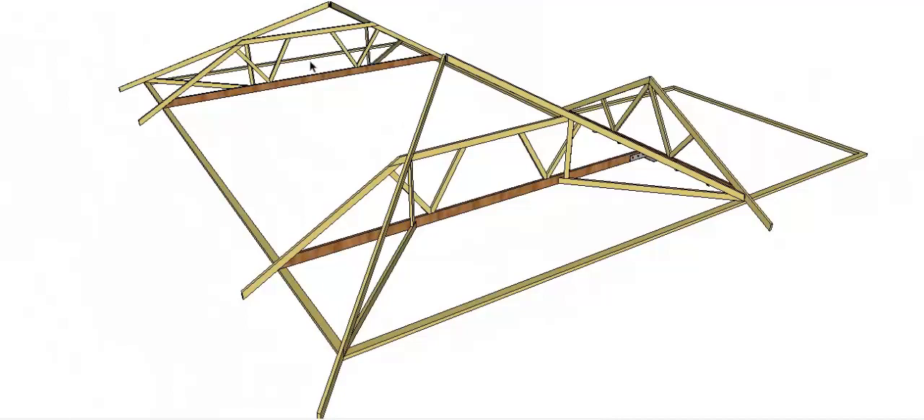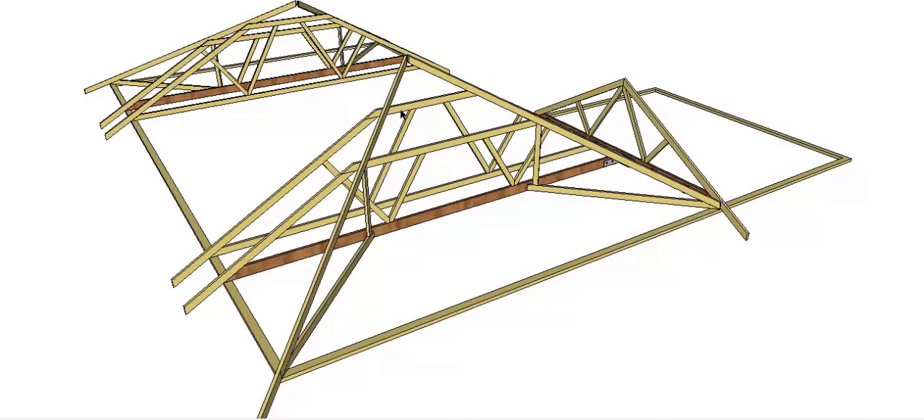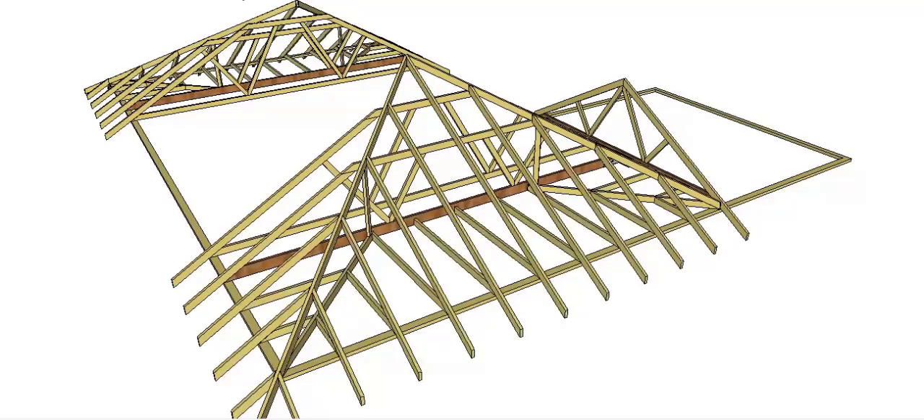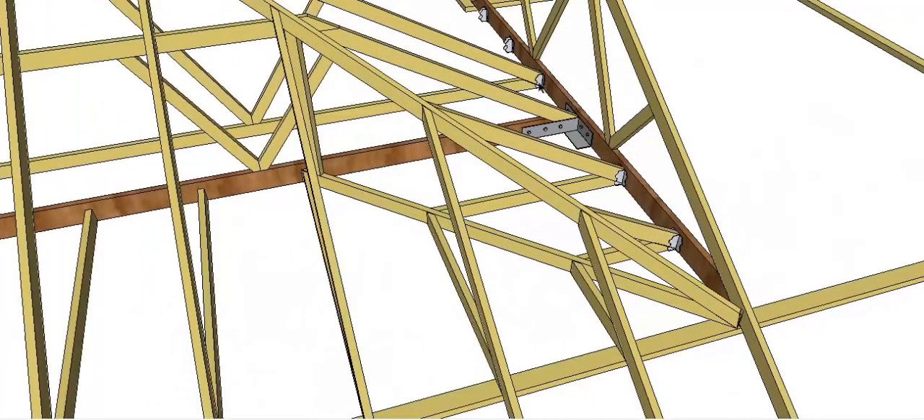Once I've got my hips in and everything is braced up, I generally like to stay out and finish my hips. So I will throw in the remaining truncated trusses, which helps support my hips — get all that lined up — and then I can put in all my jack trusses. You can see over here this one, the boots are already set up. They just drop in there — no tails on this end, so they just butt straight into the boots. No tails on the end of that truncated, so you need to be careful about what truss you put in the right place.